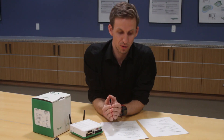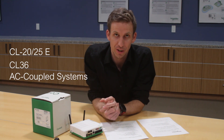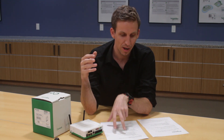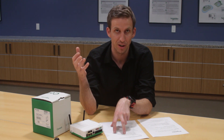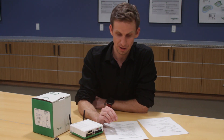With multi-cluster support, we've also introduced monitoring of some Modbus devices, starting with string inverters. With build 1.03 we support the CL25 and CL36, including in an AC coupled configuration. The user interface will show how the CL is on the output side of the multi-cluster. We've also introduced support for power meters, which are required on both the input and output of the multi-cluster side for larger systems. The supported power meters are the Modbus meters PM3255 and the PM800 series from Schneider Electric, which can be sourced through your local Schneider Electric office.